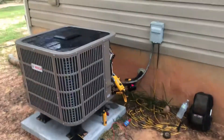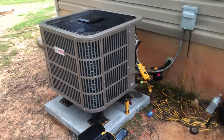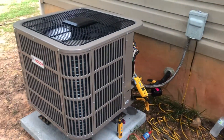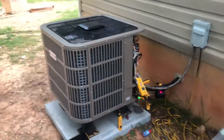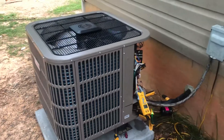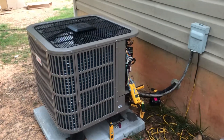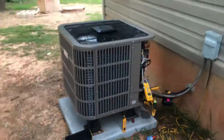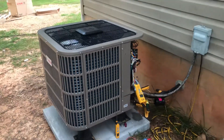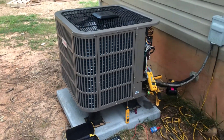I don't want to think about a breakdown, but if that were to happen I've got the warranty, so that's good. The sucky part is there are no parts for it yet, so I'd be waiting with no AC. That's why I did opt to put the heater pack in — I wired up 5 kW out of my 10 kW — so in the event of a failure in heating mode I can still rely on that. I'll try to use it without it first and go from there.